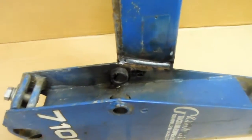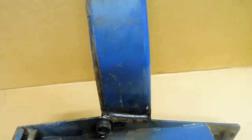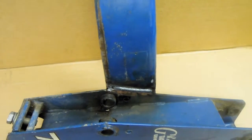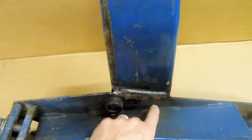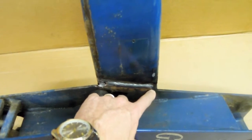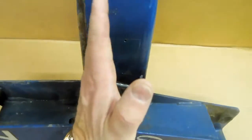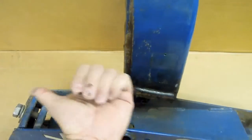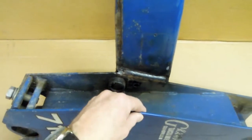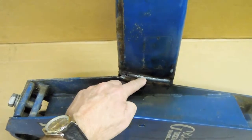What I discovered is that this vertical component right here actually started — probably through fatigue, metal fatigue — it started to crack. What I'm showing you right now is after the fact; it's already been repaired. They pulled it back into position because it had actually started to work this way and it split. This is the top side, and it actually started to split here and sag this way. This member can't move, so as the weight was put on the loader, it started to twist and started to rip or split right here, working its way down.